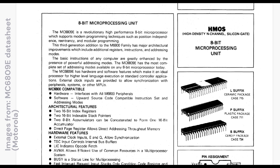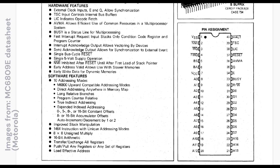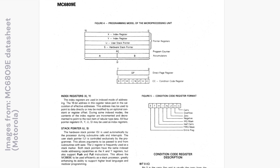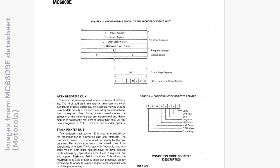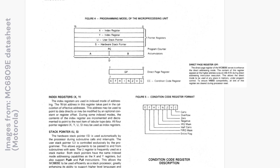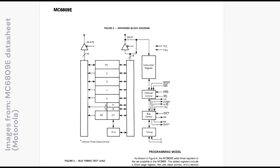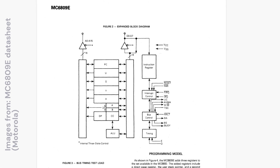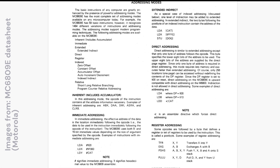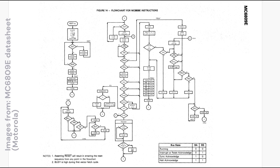It's the first microprocessor ever to have hardware multiplication. It has 3 interrupts and more uniform registers. People in the 6502 world sometimes show that by using page 0 you have 256 registers — in the 6809 you can use any page in memory as page 0. The pinout has some bus control to support DMA and sharing the bus more easily with other devices. The instruction set architecture is primarily orthogonal, has many flexible addressing modes to support compiled code more efficiently, and supports both position-independent and re-entrant code.